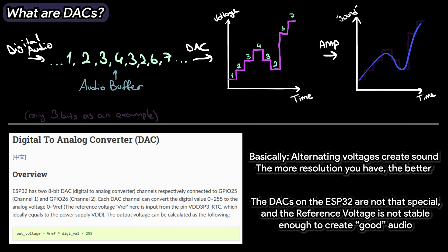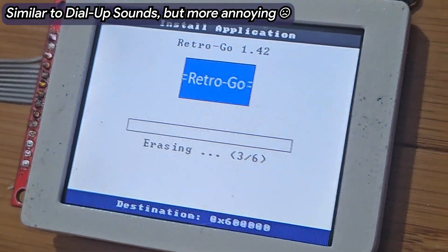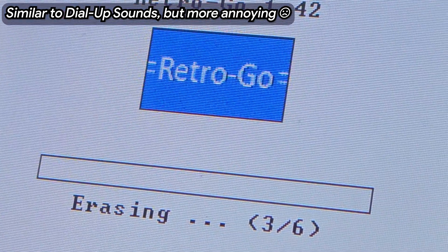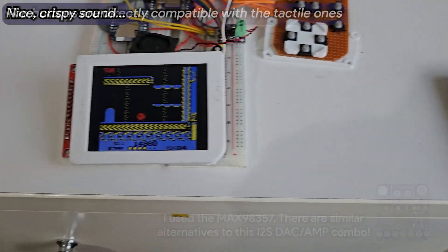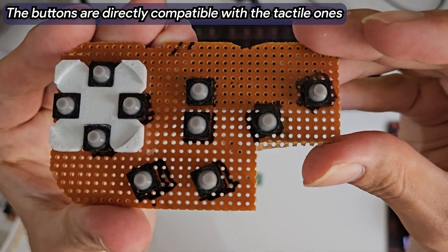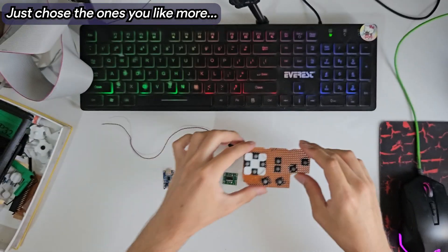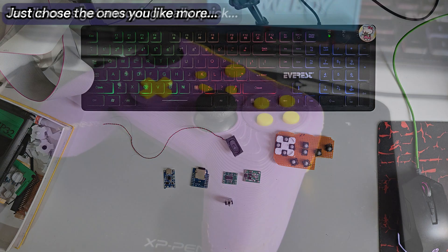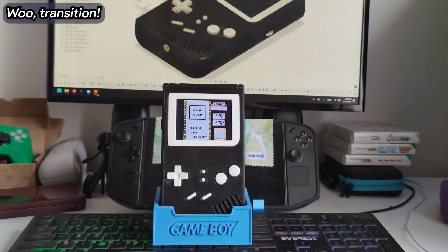For audio generation, there are two options thanks to the firmware being used. The ESP32 has internal DACs — digital-to-analog converters — which can create sound with an external amplifier. But on some boards like mine, noise from nearby pins seeps into the signal and causes an annoying buzzing sound. To solve this, an external DAC and amplifier combo can be used for clearer sound. The buttons used are 8mm by 8mm rubber membrane soft-touch buttons, chosen over tactile buttons because the tactile ones were too loud due to their clicking noise inside the 3D-printed shell.